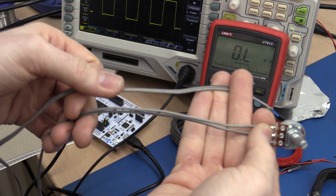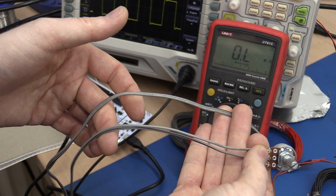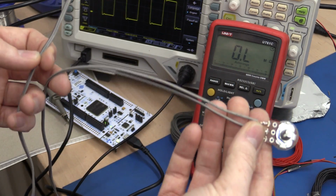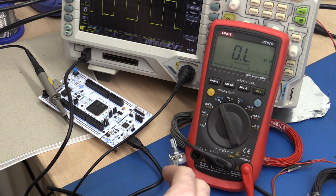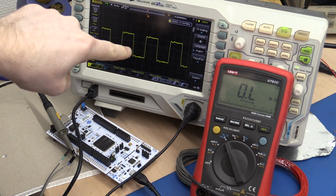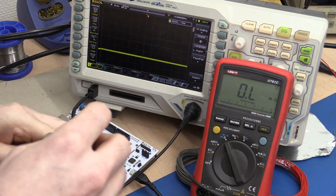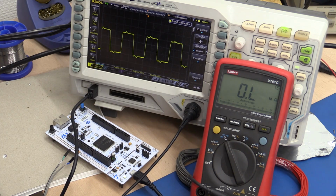This is not a good cable for any high frequency communication at all, and you should really use a cable that's made for it, like a Cat5 Ethernet cable or something like that. And for that cable you will also get the characteristic impedance specified by the manufacturer, so you don't have to guess it. So just for completion, here we see at the transmitter end, and for good measure we give it a try here at the receiving end.